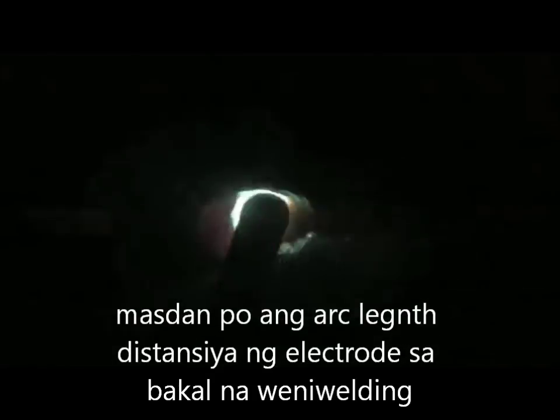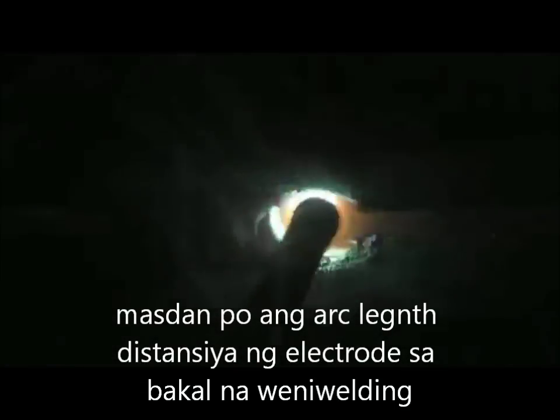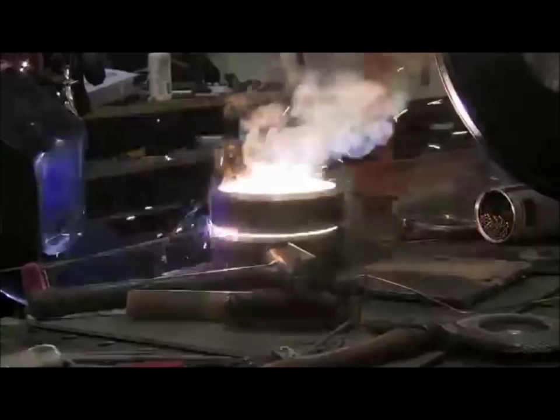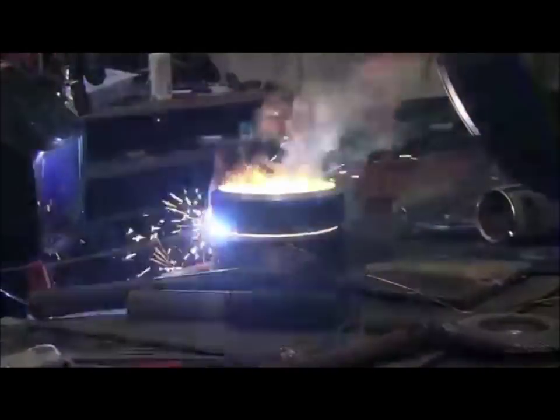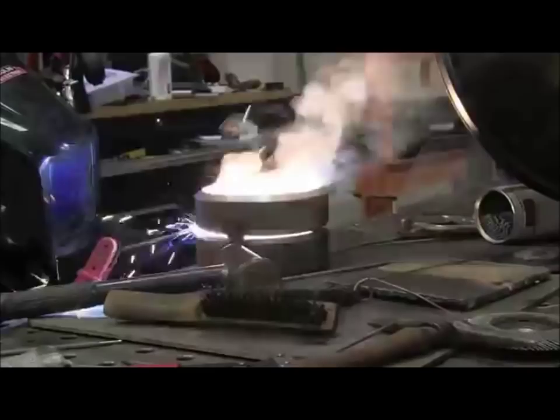and it's not going to be the same. Machines make a lot of difference. That's why pipeliners and rig welders are so particular about using their Lincoln SA200 versus a Trailblazer or something like that, because the arc makes a big difference. You need to be able to adjust the arc, and machines have different characteristics, and some of them will let you adjust as you go by using a longer or shorter arc, and it makes a huge difference on an open butt root pass.